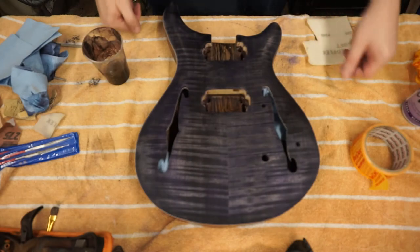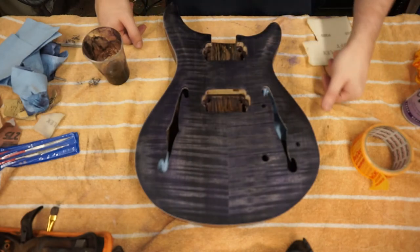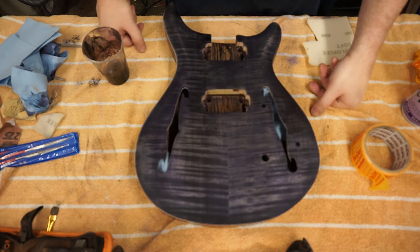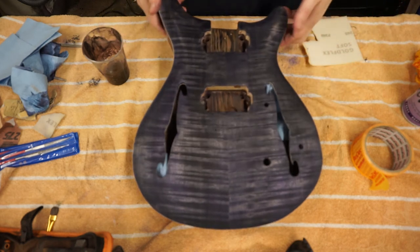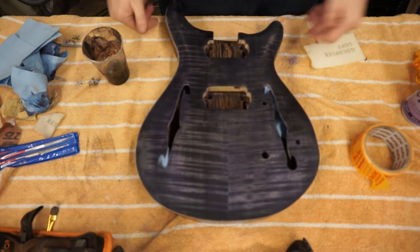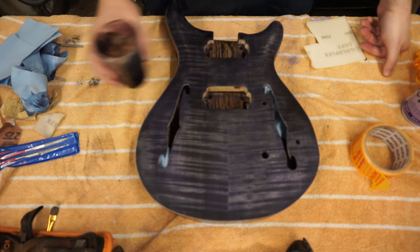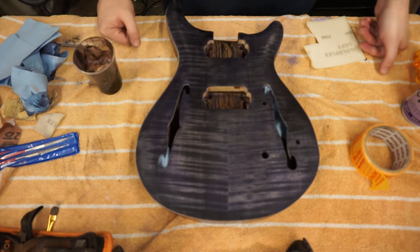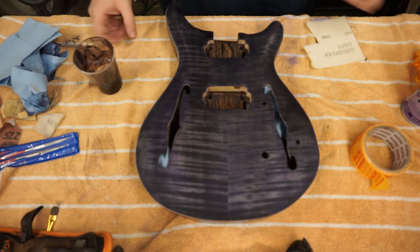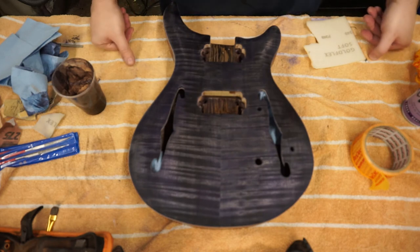So that's been sanded back. There was more black came off than I would have liked. How that's probably looking to you on the camera now actually isn't too bad, but certainly in the room there's quite a lot of light spots that are just a little bit too light to me. So I'm going to try another coat of just a little bit diluted down black just over the top of those areas. Hopefully they should seep in where the sealer has been sanded through.